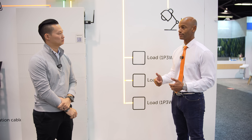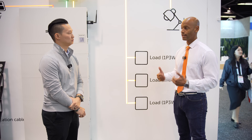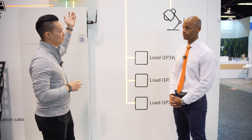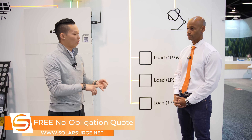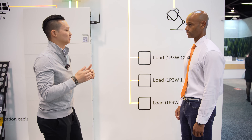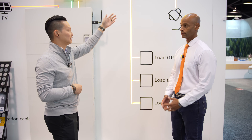As we're recording here in Southern California, they lost one-for-one net metering last year, so a lot of folks installing solar and batteries now want to use that battery on a daily basis rather than sell energy to the power company at a discounted rate. Tell us about how XPower works in a self-consumption mode. The backup interface has a CT built in with a revenue-grade meter, so we can see home consumption as it relates to PV and battery state. You can set it up so that you don't ever export to or pull from the grid — everything you generate from PV you store and then self-consume. Panel balance is the first priority, so all PV and battery offset whatever's happening in the main panel.